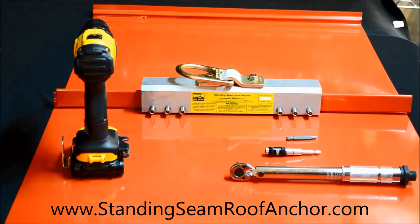So you want to make sure when you locate this on the seam, you need to have a competent person on site that knows the proper location to put the anchors. You want to be 4 feet from any fall areas, from any edges of the roof. You don't want to be within 4 feet of the end of the panel either. So make sure that you have a proper OSHA-approved safety plan of where to mount these anchors before you do anything.